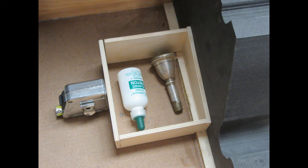I usually arrange for the storage box to be located on the bottom of the case with a padded lid that the instrument touches when it is in the case. For this particular case, this meant having the storage box taller on one side and then sloping down to a shallower dimension near the bottom edge of the instrument. I usually make the storage box out of scrap pine strips or scrap 1/4-inch craft plywood, and epoxy is used to hold the pieces together and to the case.